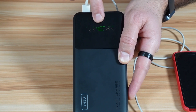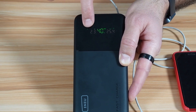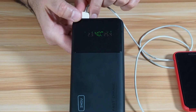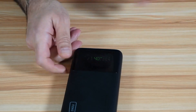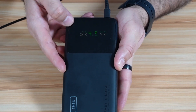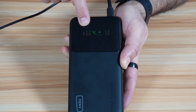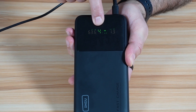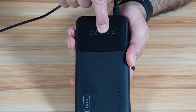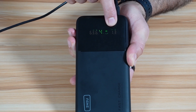And this is the percentage of charging remaining. And this is the time of charging remaining if using this power, which is 2.4 amps. If you're charging the power bank itself, these values will differ. I'm going to plug the 65 watt charger in and give it a moment to adapt. You're going to see that the power bank is drawing 63.6 watts from my charger. When the big number blinks, it means it is charging. And if it is fast charging, there is a small lightning symbol here. And this is the time remaining for the power bank to fully charge, which is 1.3 hours.